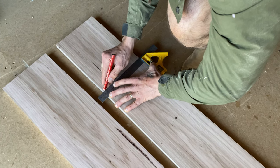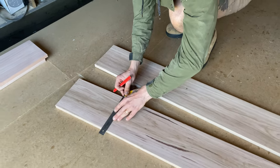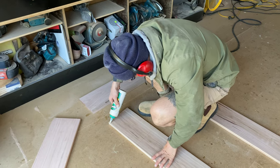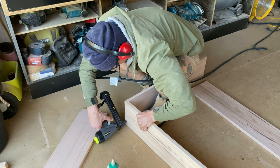This is where the shelf would sit. Making sure I left a mark on the side of the line to show where to attach the shelf, I glued the top edges and used my nail gun to join the top to the two sides.